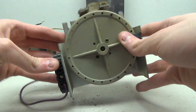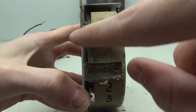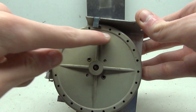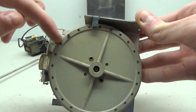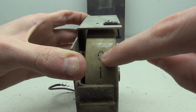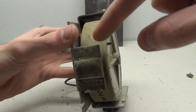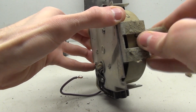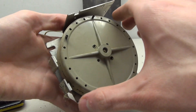First we'll look at one of the rotodials. This is what you see from the front — obviously the only thing visible is the little lens. However behind it there is a large disc that rotates. On the side you'll notice there are a bunch of holes around this disc, and there are these little pins in here. When I rotate it, it hits this metal bar limiting the rotation from G to 3. The letters are permanently engraved into the disc. Some other rotodials I've worked on, such as an Otis rotodial, have it where the numbers could be changed, but this one is set to whatever it was engraved with. This little lens can be taken out — it needs to be cleaned — and then we can take the limiting piece off and the entire piece can be removed.